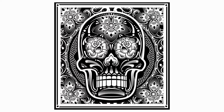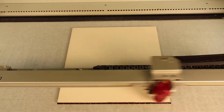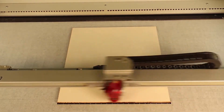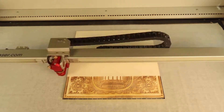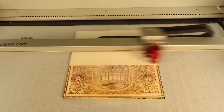Here's an example of a file that I will process onto a large piece of unfinished birch plywood. For this laser hack to work, the engraving graphic cannot be too detailed and can only be black and white style graphics with no grayscale or photographic images. It is recommended to increase the laser power and run at slower speeds or higher laser powers to engrave deeper than normal into this type of material.